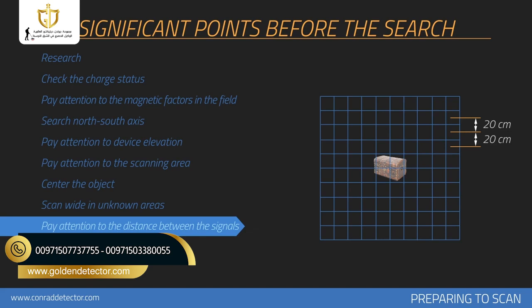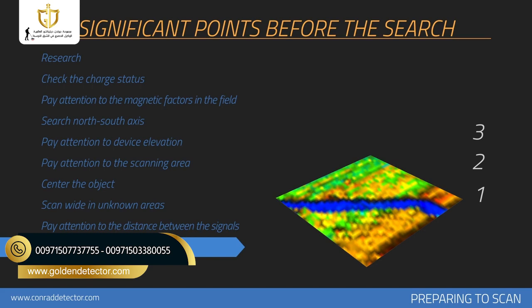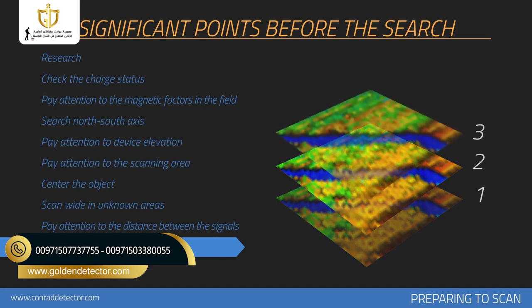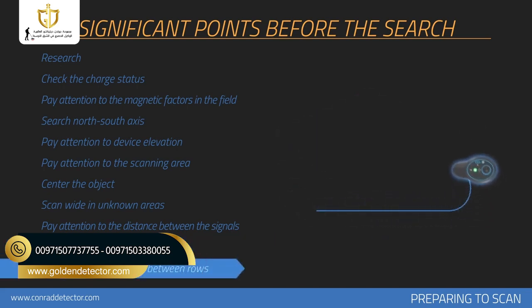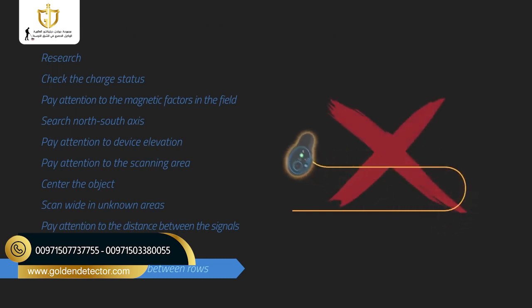If you are searching for smaller objects such as between 20 to 30 centimeters, you should increase the frequency of signal pulse intervals. If a buried object remains under soil for longer amounts of time, the magnetic field it will produce will be higher and it could be detected easier. You should check the target at least twice by performing the search in the same manner. More measurements will help eliminate minerals and correct errors. The more control scans performed on a potential object, the better your decision will be about whether the item is a real object. You may perform zigzag or parallel scans, and the measurement device should not be turned between rows.